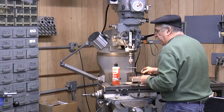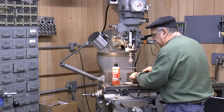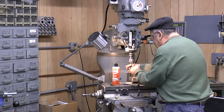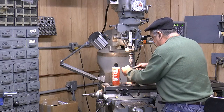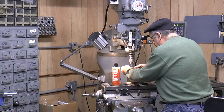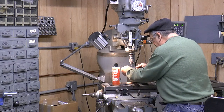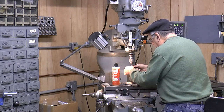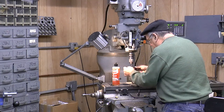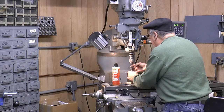It's supposed to be a 136 thousandths tap drill size for 8-32. I used a 139, a little bit bigger, because you got plenty of threads. It's not holding on to anything important. No tension on it. Go down. Do you feel it tight? That's it right there. That's the bottom. If I had to go deeper, I can put a bottom tap in and go deeper.